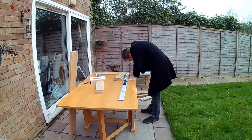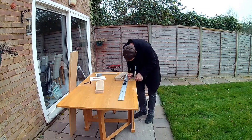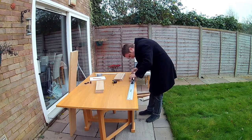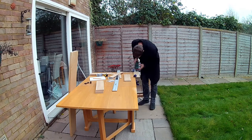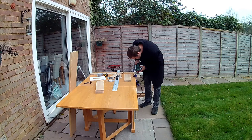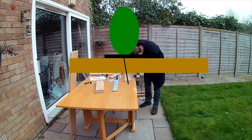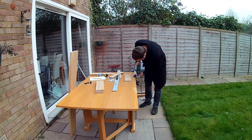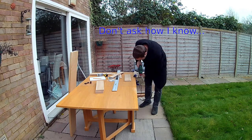With all the raw materials assembled it was time to start cutting. The small boards were about the right length to match the shelf width, so I carefully marked lines to allow me to cut the shelf base and the shelf lip on each board, and then mostly ignored them and just ran my jigsaw down about halfway between them. This was quite deliberate — I knew from previous experience that jigsaws are very inaccurate, at least with my skill level. Even with a guide they tend to wander a bit, never producing a perfectly straight line, and the blade can flex meaning the cut might not be perfectly vertical. On a board this thin that shouldn't matter too much, but it can be disastrous if you try to shorten a door.